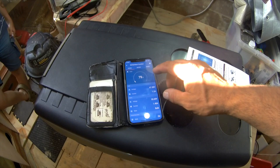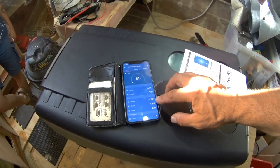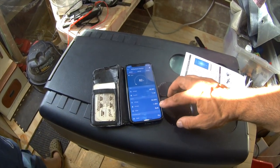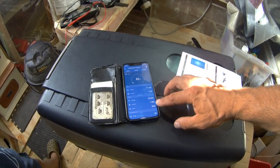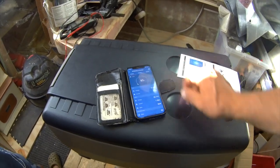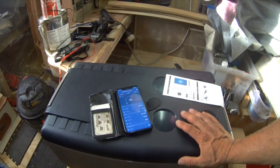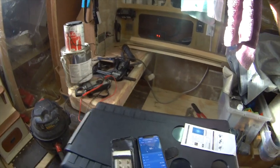So it looks like, 19? Yeah. Wow. So it's right now at 80 watts, and I started with 53.02 volts, so it's actually charging right now, and it's only doing 1.5 amps worth of charge. I've increased it to allow it to do 3 amps of charging, but it looks like I don't really need it here. So I'm still going to do the math to try to figure out what this is actually drawing once the sun goes down. I'll turn everything off and I'll take a look here.